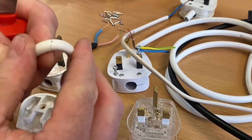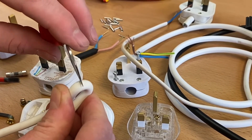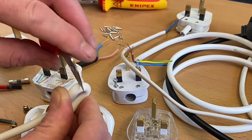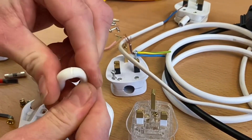I'm going to move it round to another area, into another position, then gently take my knife and just get it to burst through. Just pressing nice and gently, no rush at this stage — students will be pressing too hard and potentially damaging the inner PVC. So it's burst again — move it round to a different position.